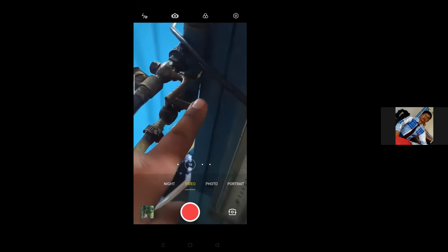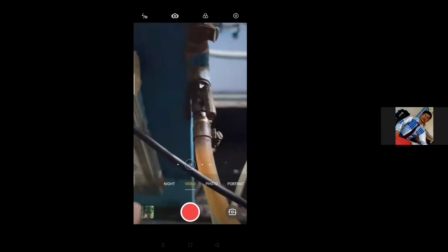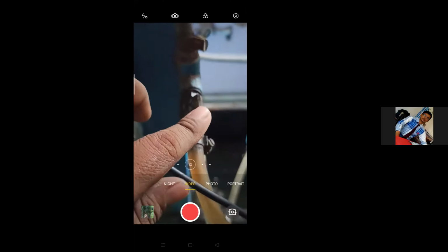So when we are doing the reading practical on the venturimeter, at that time only the venturimeter valve should be open, and the orifice meter valve should be kept closed. Are you getting my point? So that water will not come inside through this pipe. Similarly here also, only the venturimeter valve should be open and the orifice one closed.